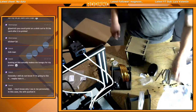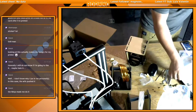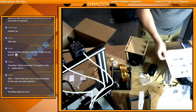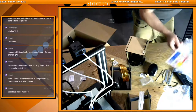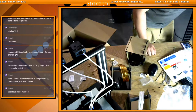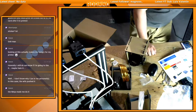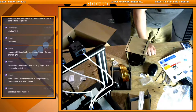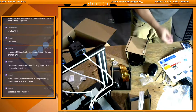So that's actually nice. I'm still wondering why I have so many screws left. Assemble the gantry frame from the bottom with the M3x5 screws, and assemble the fixed sets of extruder units to the back side of the top gear. M3x16 screws, fair enough. The washers, and a total of 3 sets were assembled.